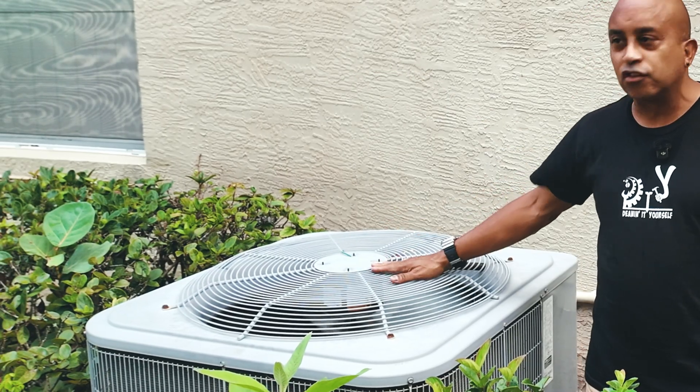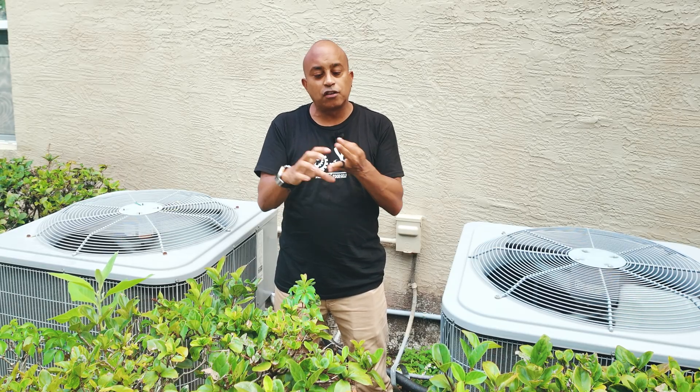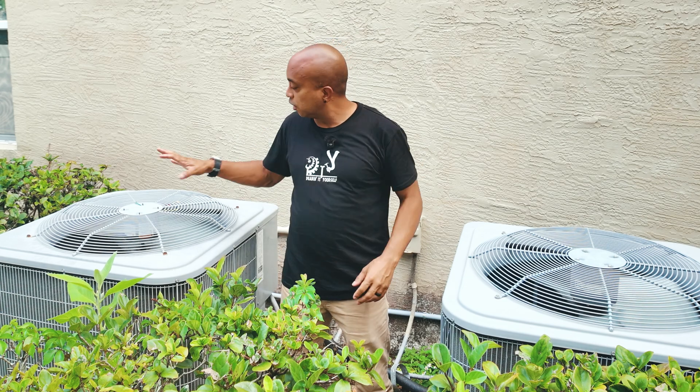As you can see here, both of my units are running. We got the fan motor replaced and it's good to go — everything is working awesome. I hope you guys found it helpful, and if you did, please give me a thumbs up, like this video, and share it with your friends. Make sure that you're subscribed so you can stay up to date with all things that I do DIY. The replacement of your fan motor is another common problem apart from the contactor and the capacitor — those are the three main things that could go wrong with your AC unit, and I believe they are something that every homeowner should be able to tackle. If you followed me in this process, you learned how to troubleshoot your contactor, troubleshoot your capacitor, and replace the fan motor. The fan motor is no big deal — you just take off the housing, disconnect the fan, slide it off the shaft, put on your new one, reconnect the power, and you're good to go. Thank you guys so much for watching. I hope you enjoyed it, and until next time, I'll catch you guys in the next video.